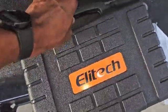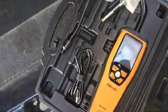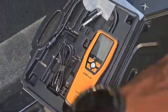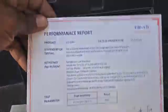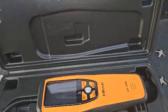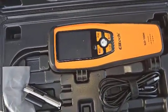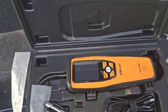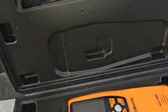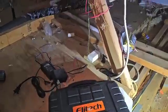All right, it's back people. This is the ILD100H by Elitech — the ILD100H is a heated diode leak detector. We got a unit that's low on refrigerant, so I'm going to get it to stock and do a review on it and see if we can find the leak. We got a unit with about 80 PSI on the suction line — 410A — so we're going to pull it out and see if we can get some footage of the ILD100H. All right, here's the unit.